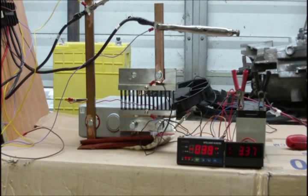leaving those morbid concerns aside, I should have to say that I've been very impressed with what I'm seeing about the little grey cell, so we'll see how it performs on this particular battery of tests. A nasty feeling I'm not going to be able to hold the impulse current for very long. I've done some high current experiments more just for fun with transformers and just heating up pieces of steel and that. Now the voltages I would have been using on the transformer would have been actually quite similar to what we're going to have here, probably around 2 volts, 2.5 volts, but a couple thousand amps. Unfortunately my clamp-on DC ammeter only goes up to 400 amps, but the JLD will take us up to 1500.